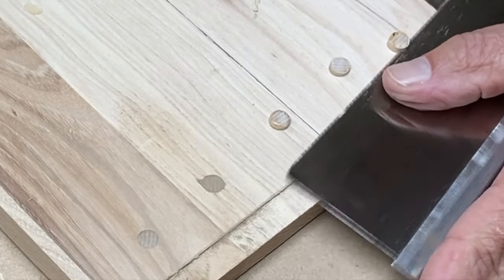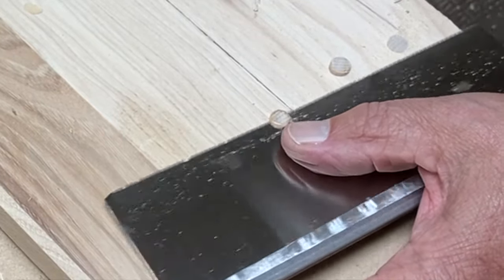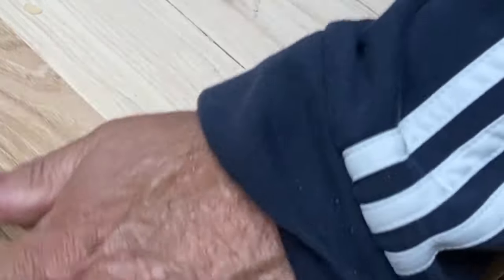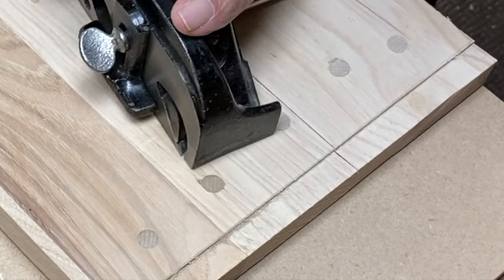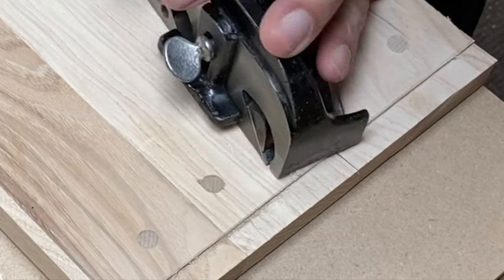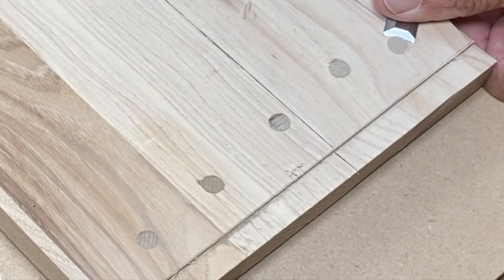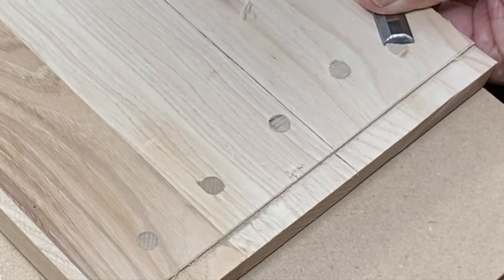Just as a point of interest: a Japanese saw on its side with a little bit of pressure down on the blade gives you a nice clean cut without marring up the surface of the wood. Here's the Stanley 78 again — this is probably not the right choice for leveling dowels because that little nose or toe of the sole is kind of in the way. I would probably not suggest using a Stanley 78 for this purpose.